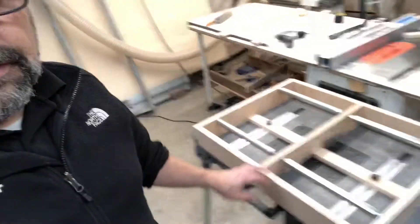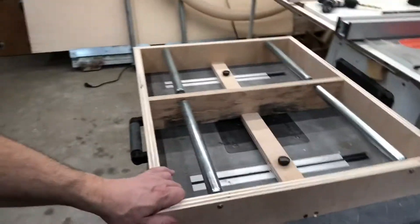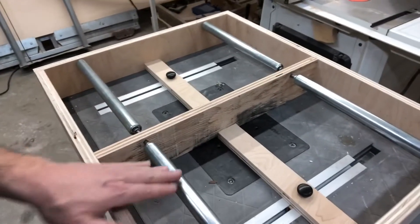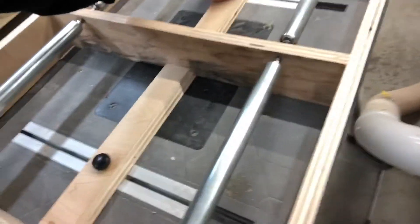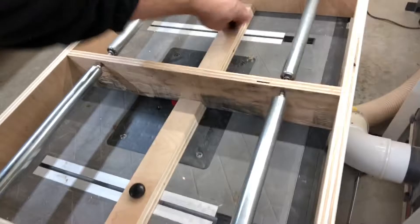This is the sheet of plywood I'll be using for the Jintani project. The Jintani project is gonna be about three feet tall and I'm gonna be kerfing vertically three feet, so it's gonna be a pretty big unruly board. I didn't have a good outfeed table so I just whipped this up. You can buy these rollers on Amazon for about ten bucks each — they're the UXL brand. I built this little frame and the rollers are the exact same height as my table saw. I used the T-slots in this table with little knobs so the whole thing slides on and off and tightens down easily.